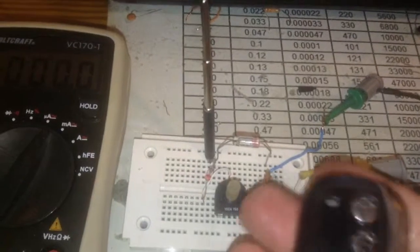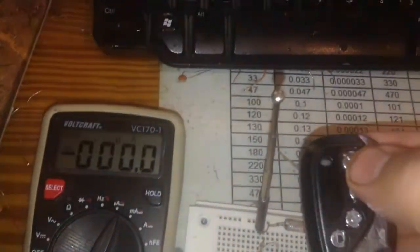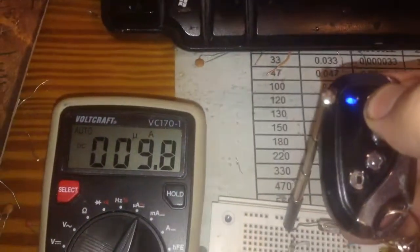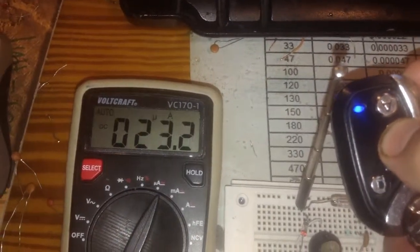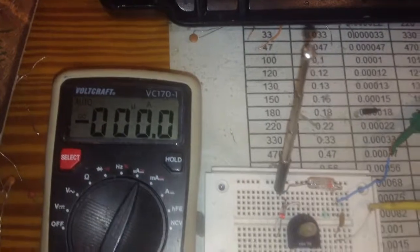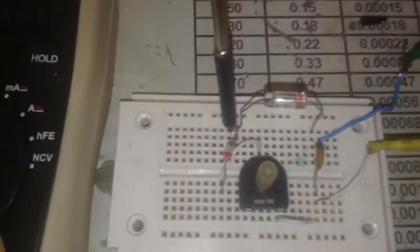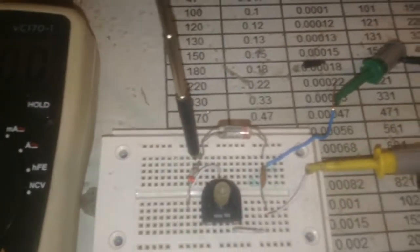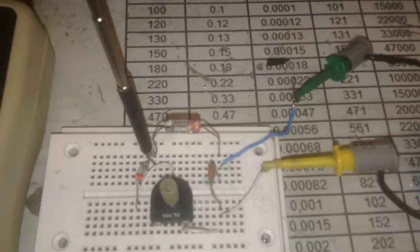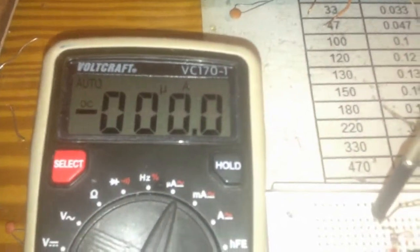First I'm going to test with this dual key — all projects will be tested with this one. You can see it is working really nicely without any battery. The modulated frequency will come to the telescopic antenna, the germanium diode will filter it through the capacitor path, and finally the current will run through the meter.